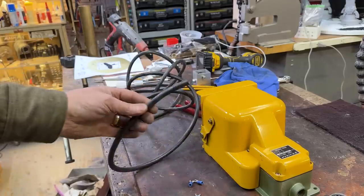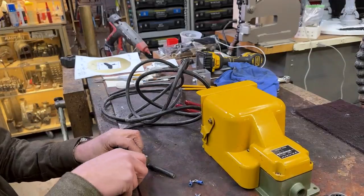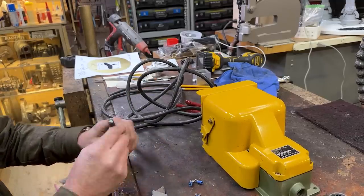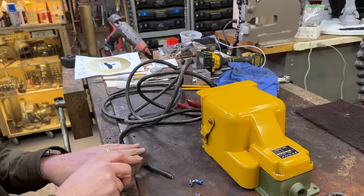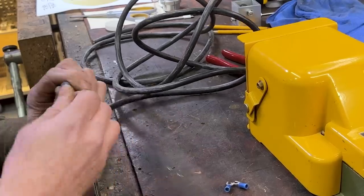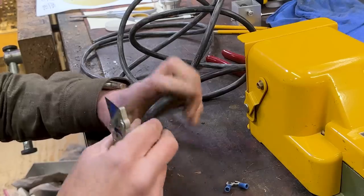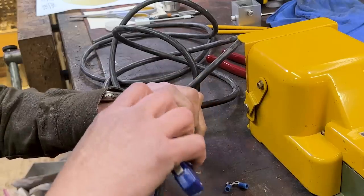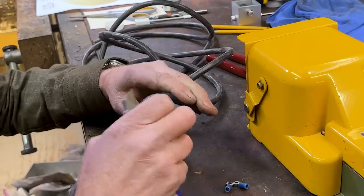When you're cutting electrical wire like this, stripping it back can actually be kind of dangerous, and I'll explain why. You don't want to just cut through the outer side and then pull it off because you're probably nicking the wire housing inside. This is three conductor — probably 16 gauge. What you want to do is roll your blade around the perimeter just a little bit, just break the skin, and then come in with your blade and really see where you're separating it. Roll it around that slice to cut off the housing. This is just responsible electrics.